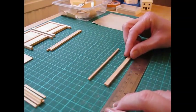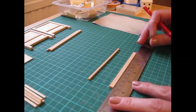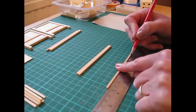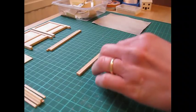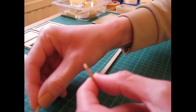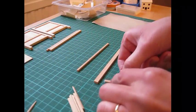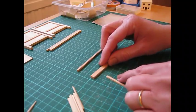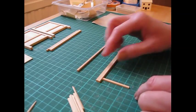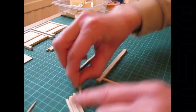Now take one upper and one lower side support and make pencil marks all the way along at 10 millimeter intervals or 25/64ths of an inch — do that on both pieces. Then take your rungs and apply a little dot of glue to each end. Attach them to the lower support first, placing each rung so it sits centrally below that pencil mark so the pencil mark is in the centre of the rung width. Go all the way along.